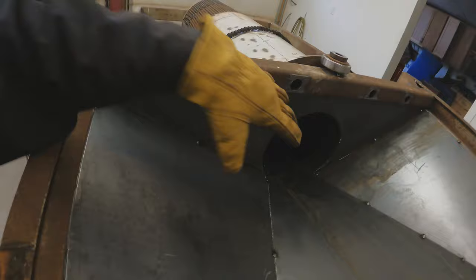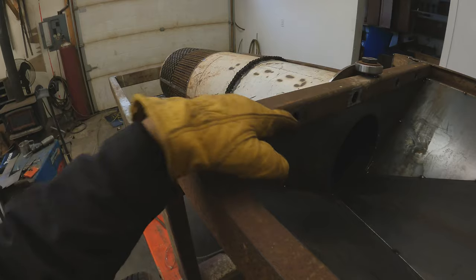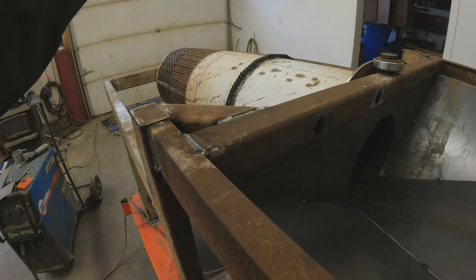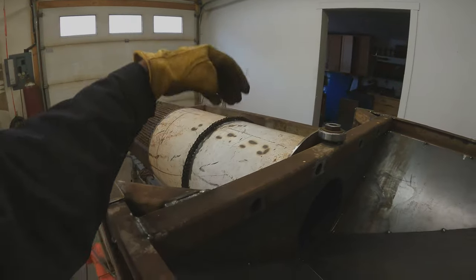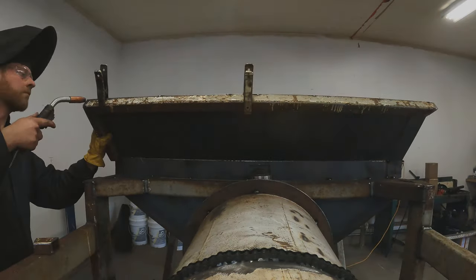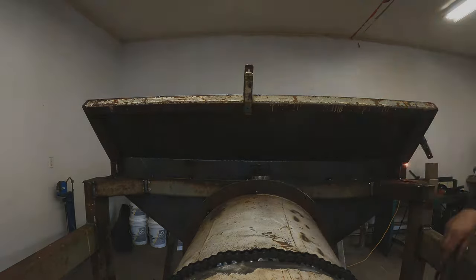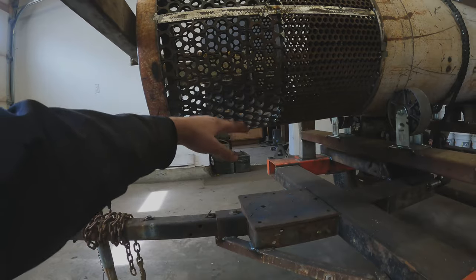I just plasma cut these holes in it. We still have to build the nozzles — that'll be the last thing we do on this. To finalize this area, I think I'm actually going to build a small guard that kicks up and over, because sometimes material on the back of your bucket will trickle onto the trommel and end up on the rollers. We'll run a perimeter around it with one and a half inch square tubing. The hopper's all done.